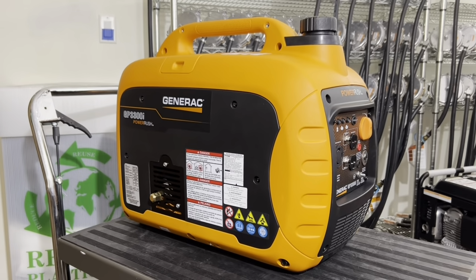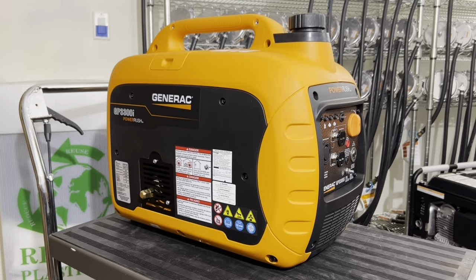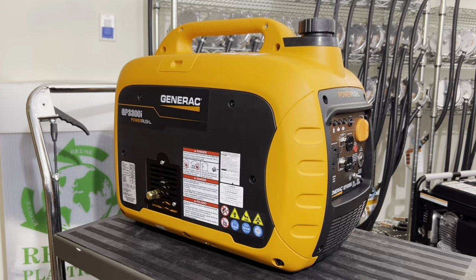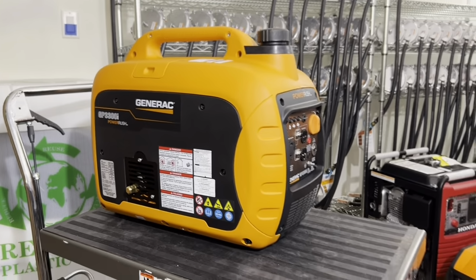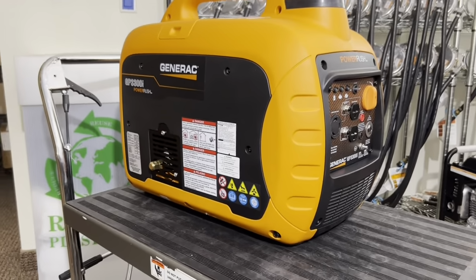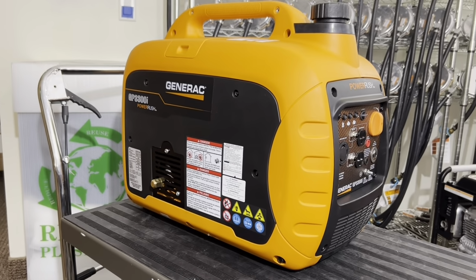I've seen folks use an umbrella. That way, if it's raining or anything like that, you're not getting the generator wet. Some folks modified a doghouse with venting on the side and stuff these generators in a doghouse. Something that you're going to cover this generator with, right? Keep it away from the elements. And especially when it's hot out too. So having this thing operate in shade is going to go a long ways in keeping the generator running cool.